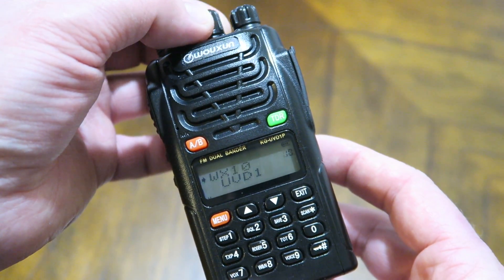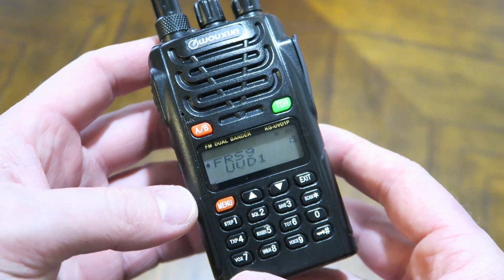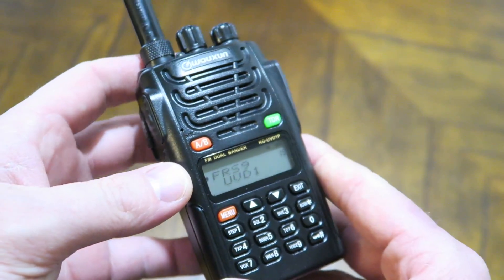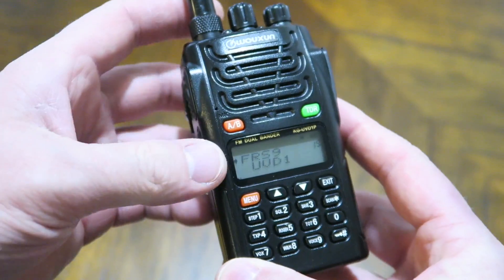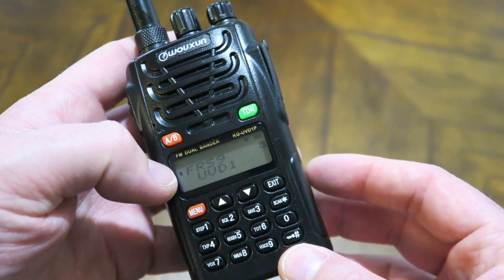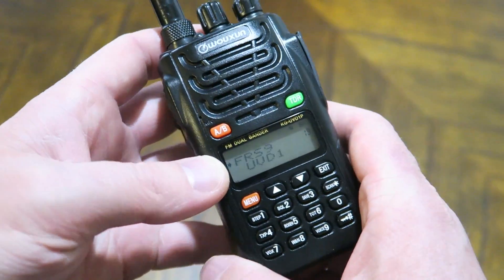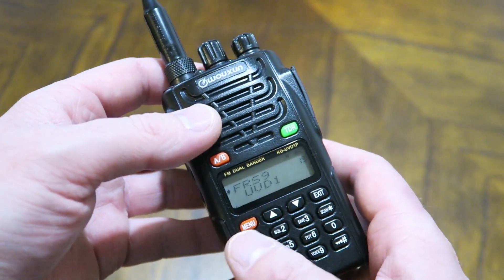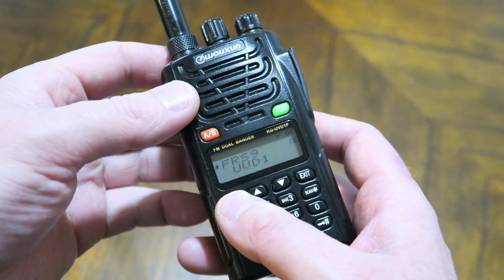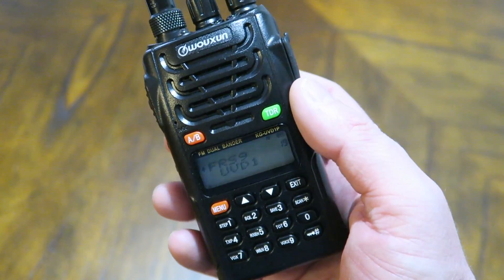I commonly use the FRS radios on channel nine, so I can go to FRS nine and communicate with users on channel nine with a standard two-way radio. I'll go back in CHIRP and program in my local police, fire, and EMS to be able to listen to those if they're nearby. It's great to have one of these in the car — if you had to leave home you can monitor what's going on around you. You can manually program these too, but it's a lot simpler using CHIRP.